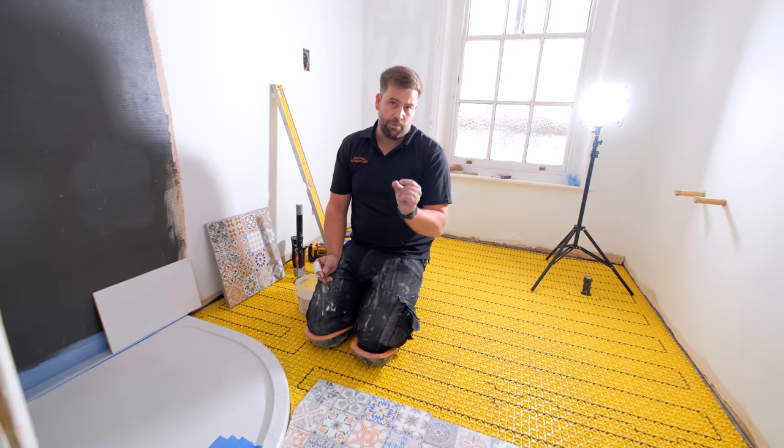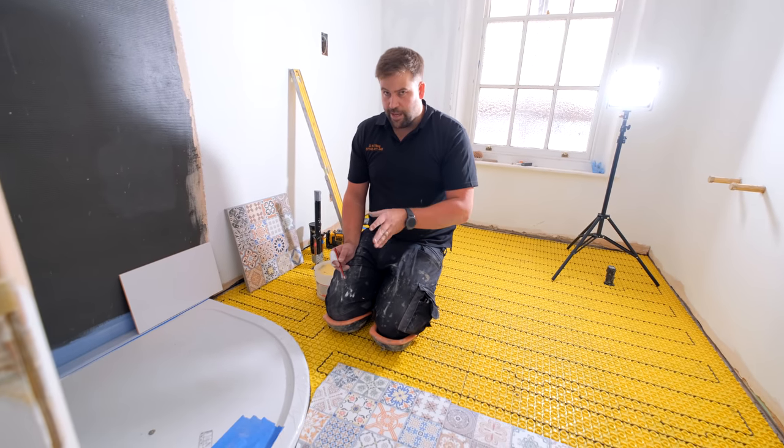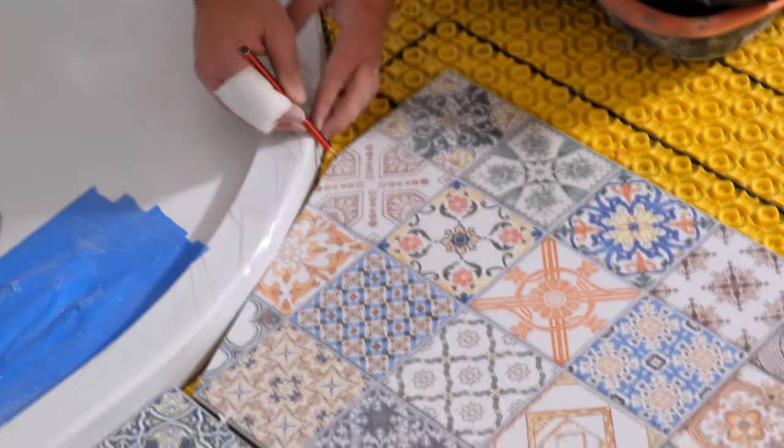I leave the line when I'm grinding, because I can tickle a little bit out after, but you can't obviously glue a bit on. So that's a little bit of a tip. You prefer to cut a bit under just to start with, because you can always take a bit more off. So we'll give it a go.